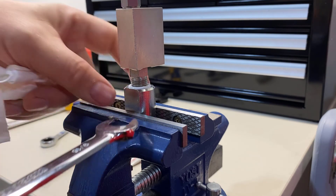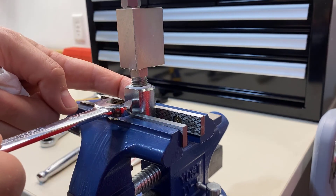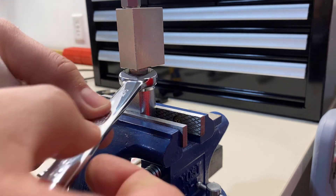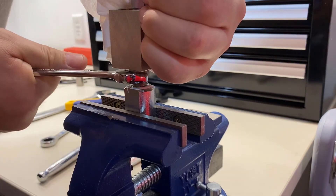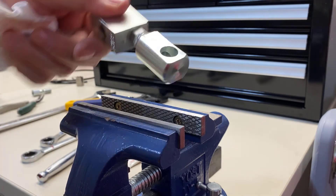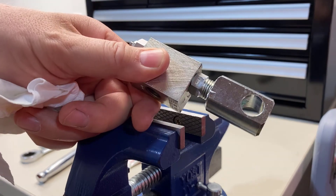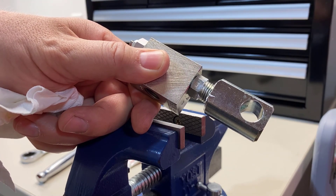In this case it matters where we stop, because you're going to want the body parallel to the flats. It doesn't have to be that way, but it will prevent it from getting in the way of other fittings and the pump body. There, that's pretty close to parallel. So now we're done with the thread sealant portion — this is nice and tight and it's not going to leak — so let's see how this gets installed onto the side of the pump.